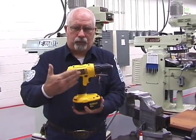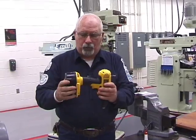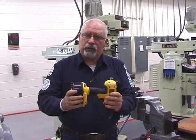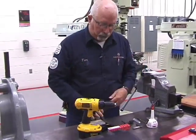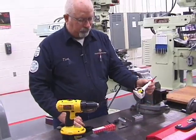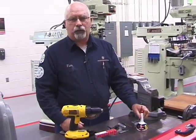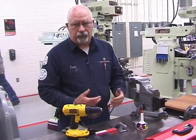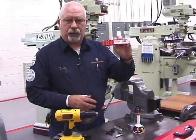This is the better of the drills because it's so evenly balanced — it's much easier to drill the hole. You should have a can of oil; this is 3-in-1. It'll do what we need, but you really want cutting oil if you're doing a lot of it because of the heat factor. This is your center punch.